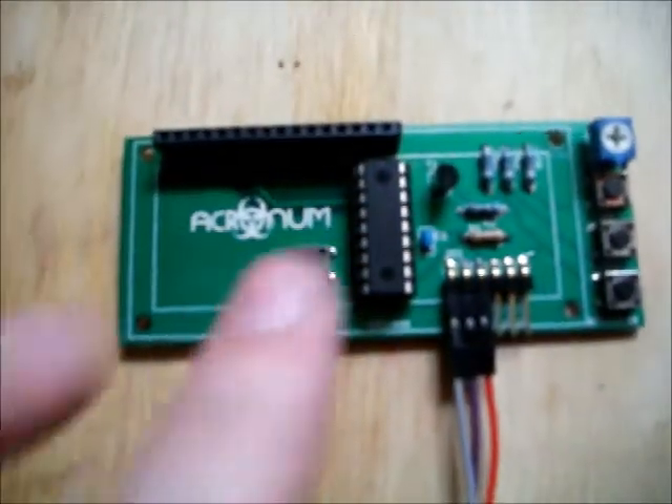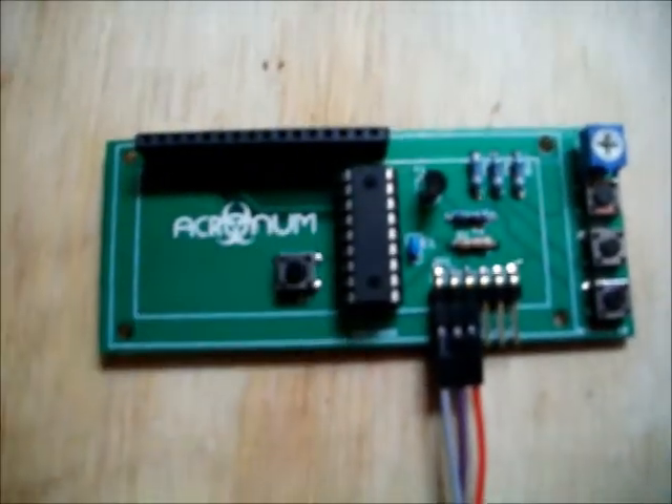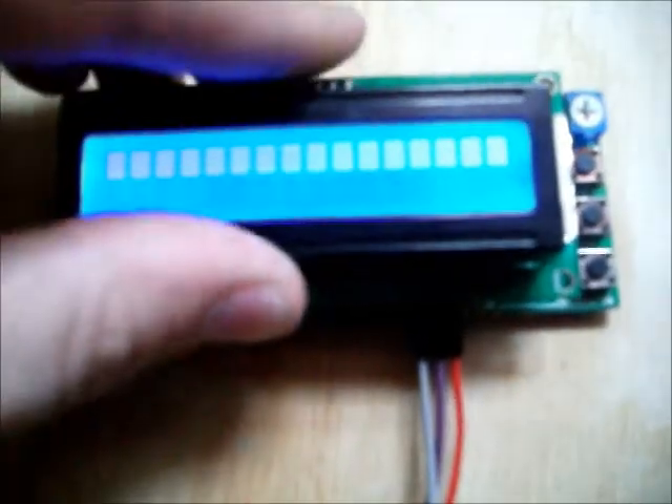Now the last important feature would definitely have to be this reset button here. If you're in a classroom and one of your students has messed with the baud rate of the LCD so you can no longer talk to it — first off you need to turn the power off to the board, and then while holding down this button, which is very difficult when holding a camera, you need to hold down this button and then press the enter key, then power cycle the actual LCD.